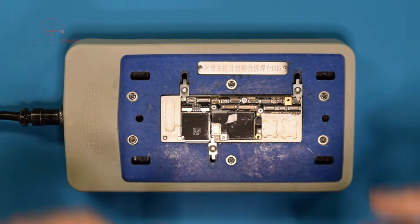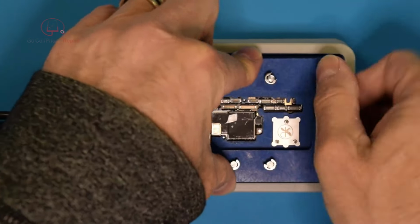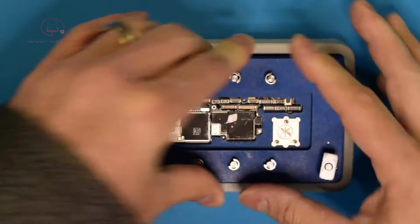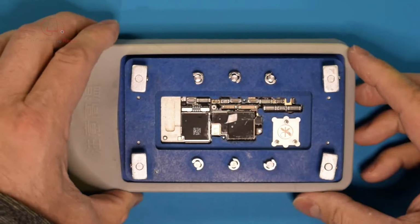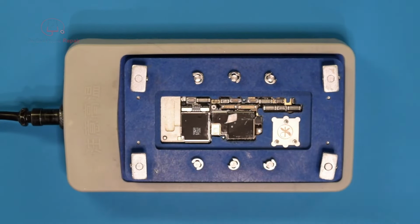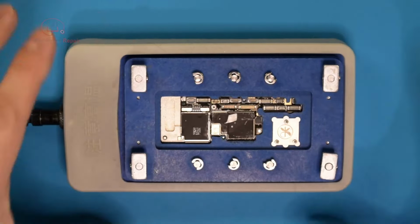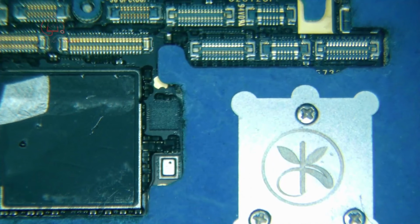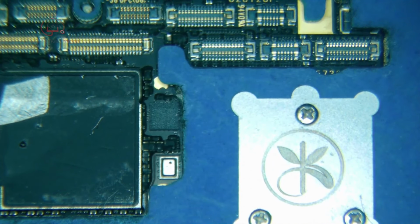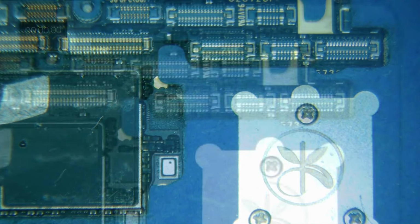Alright, so we are going to take our upper half here, and this is going to put pressure evenly on the board so that everything's clamped down into position. Now remember, you can only do this if you have your spacers inside there, otherwise you just make a big mess. Solder and everything's going to run together, but those spacers are going to allow this to put enough pressure down, melt everything, and hopefully it will realign properly. So let's get this back under the scope. And I'm not going to be able to see, so we're just going to have to start a stopwatch to time this thing.